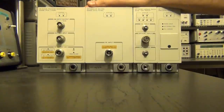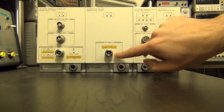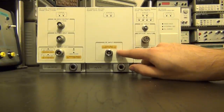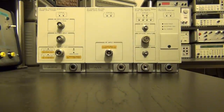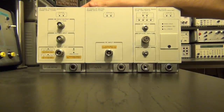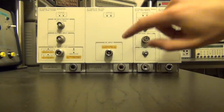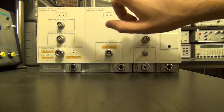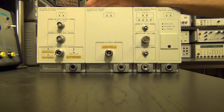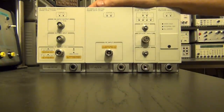Here's the main RF section where the spectral down conversion actually happens. You can see it only has one RF input in the front and it's DC coupled — it says zero volt maximum. What is really cool about this particular one is that it does direct frequency down conversion — no noisy sub-harmonic mixing — which means it has to generate very high signals because this works up to 22 GHz.